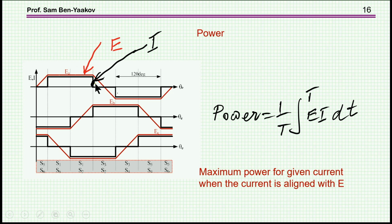If it is not, if the current is going over here or less here, then you have a case of higher harmonics, or you might say circulating current, which is not contributing to the power. Therefore the efficiency will be lower, because the losses are a function of the RMS current, whether it is in phase or not, or at the correct frequency or not. So you would like the RMS current to be exactly the current that contributes to the power.